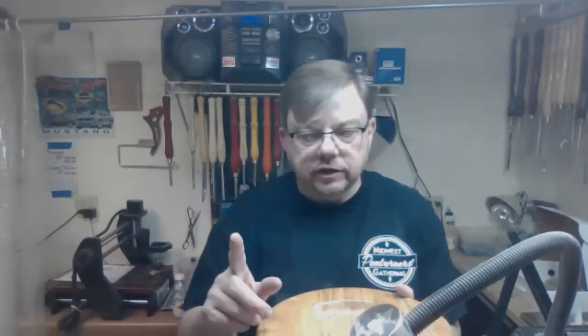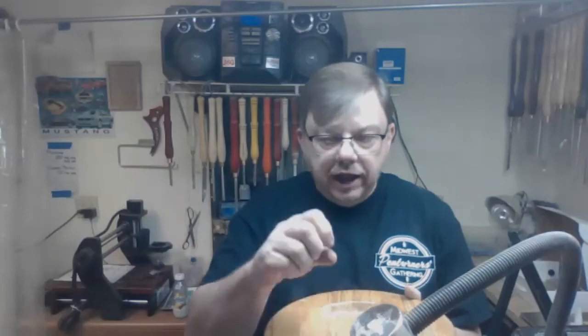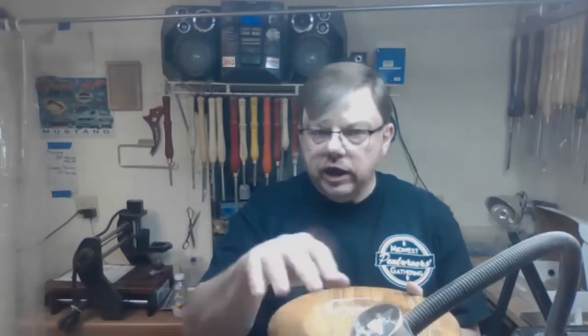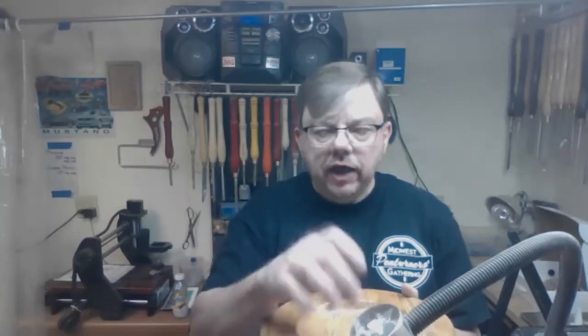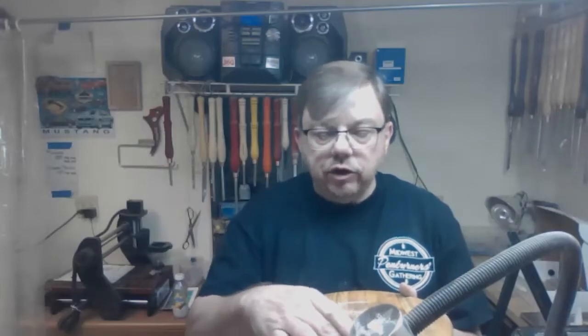And you want to build the finish on any kind of these CA products. Don't pour a lot of it in and spray it. Pour a little, hit it, pour a little, hit it every time. And that's what's going to build you up to having a really perfect finish on here. And then typically when you have that, you're only talking about hand sanding it afterwards.